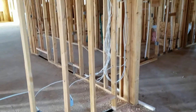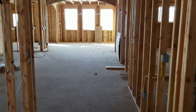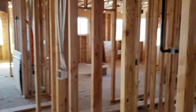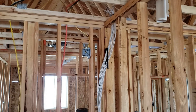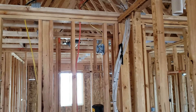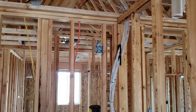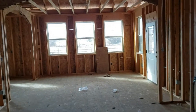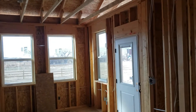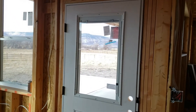All the cables from all the rooms run to that one location, with the exception of the theater room and speaker wire. We also have a cable running to the roof for an outside antenna. Since everything runs to one spot, it's super simple — the router and modem will exist there, plus a switch for all the Cat6 cables. If you're distributing satellite or antenna to all rooms, you can put a power distribution block there. For whole-house audio, having your distribution amplifier and all speaker cables come to one location makes everything much, much easier.